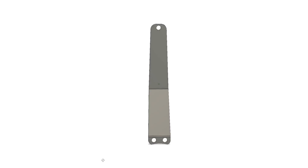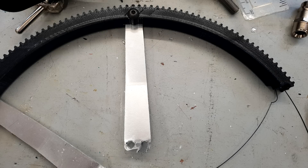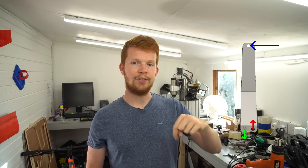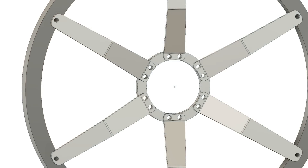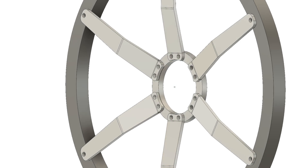This is what one of the pulley spokes looks like before it's broken, and this is what all six pulley spokes look like now. There is just too little material around the bolt holes at the bottom of the spoke, which when torque is applied from the motor puts an upward force on the right-hand bolt and a downward force on the left-hand bolt, ripping the left-hand bolt out of its hole. The reason for so little material at this point is that the pulley has to fit over the disc brake hub on the wheel, which is 52 millimeters in diameter, requiring a 52mm hole cut at the bottom of all the spokes.